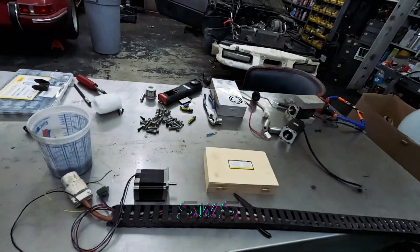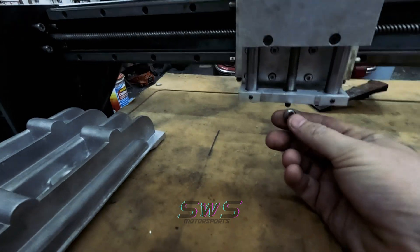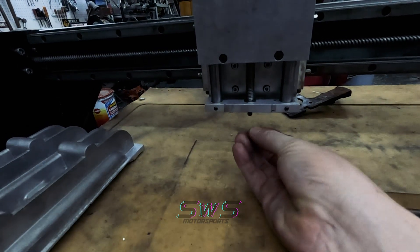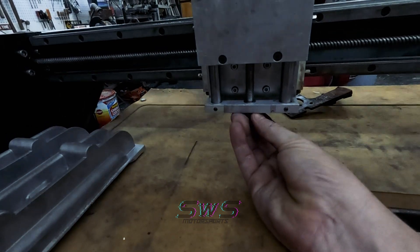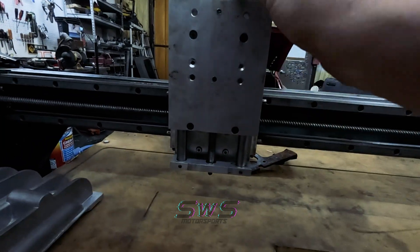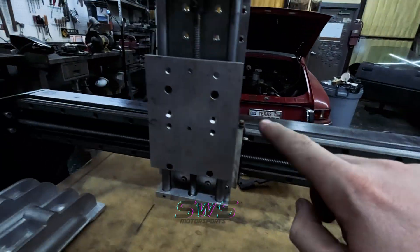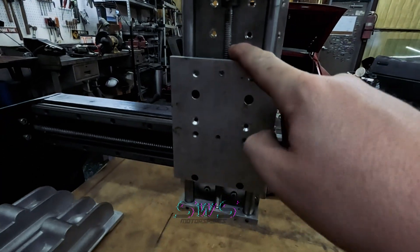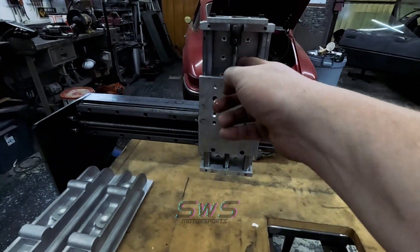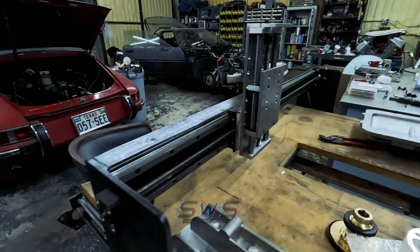These bearings have a little bit of a lip on them so they clamp around the bar. The horizontal linear rails are acme thread but this vertical one just looks like a piece of all-thread — it honestly might just be all-thread. You could absolutely make this with all-thread from Home Depot, clamp it in a drill, spin it down. You could make a functional CNC table using Home Depot all-thread if you really wanted to.